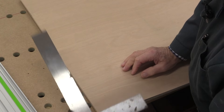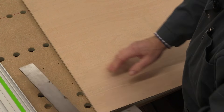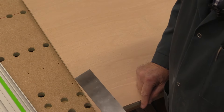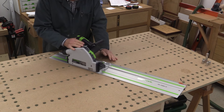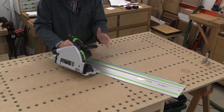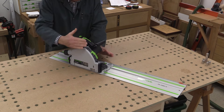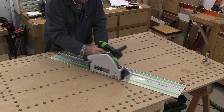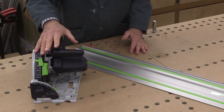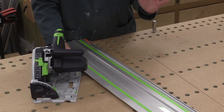I've brought you in nice and close and I've got my engineer's square here. I've just done that cut and I hope you can see that it is absolutely spot on. We're producing a system that gives you the ability to make perfectly square cuts. Now, I need to explain what a track saw is and what a track is. This is a track saw — this is made by Festool, it's a TS55. There are lots of track saws made by other companies. And this is a guide rail, or a track. The track saw runs along the track and won't be able to go left or right or skew in any way. This saw will make absolutely superb cuts; all you need to do is make sure the track is put in the right place to get nice square cuts.